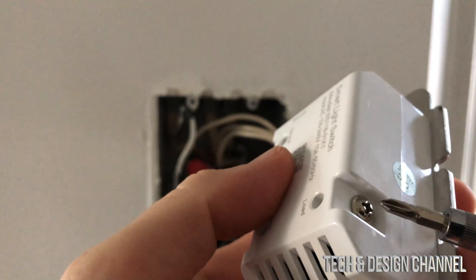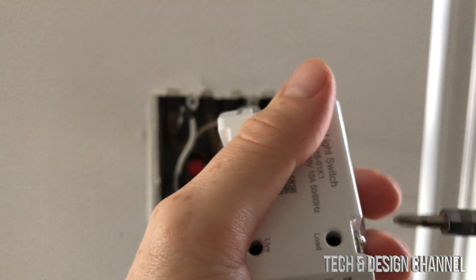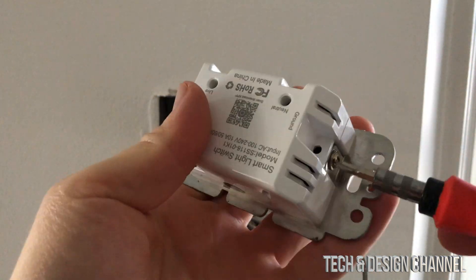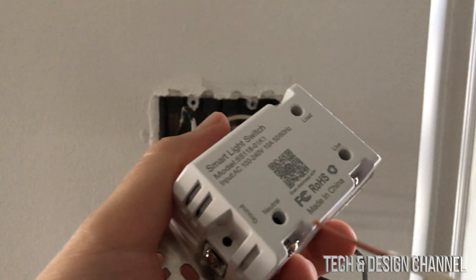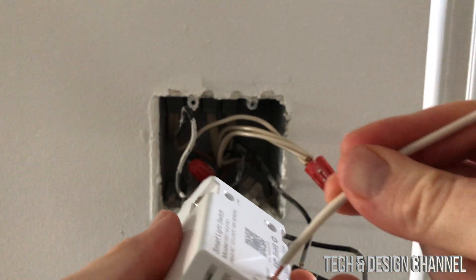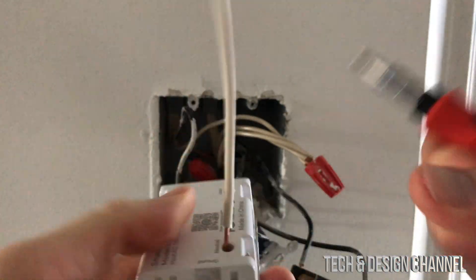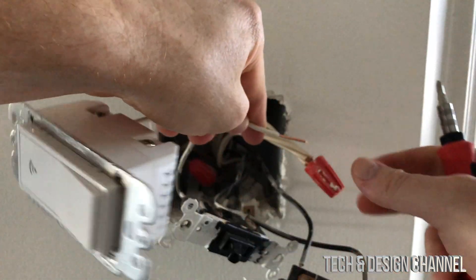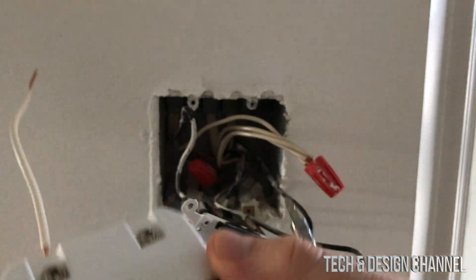As we work on that, we have to get the switch ready. With a screwdriver, unscrew the terminals a little bit — make sure they're nice and loose all the way around. Looking at the wiring diagram, the neutral (white wire) goes right in here. Once that's in, then and only then tighten it up so it stays and won't come out. Then we just connect this up, and we'll do one switch at a time — this one first, then the other.